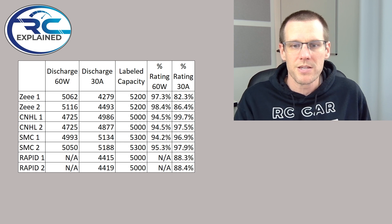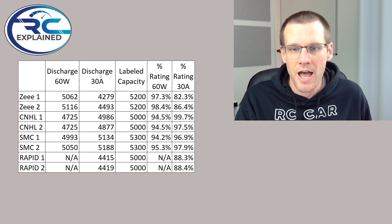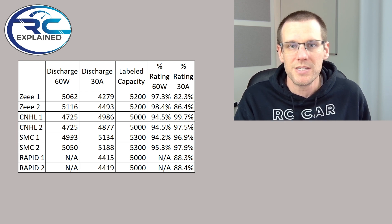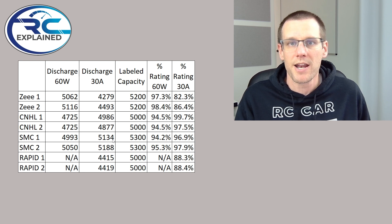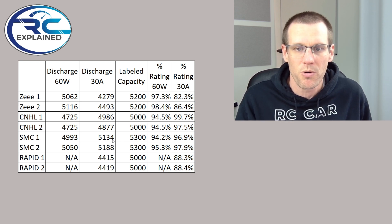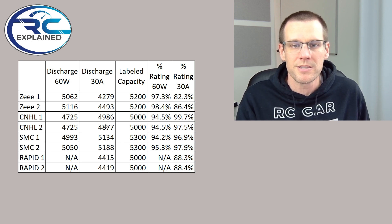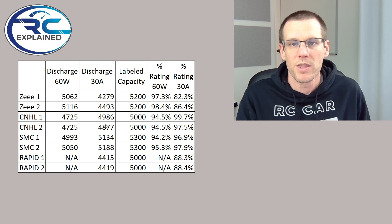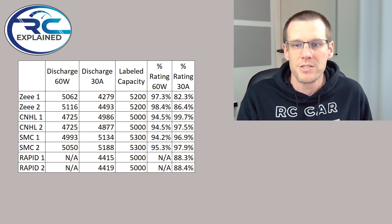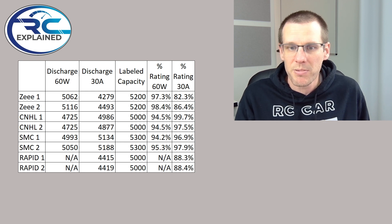What I found most interesting is that CNHL and SMC actually discharge less at a very low rate versus a higher rate. CNHL and SMC both only get about 5,000 milliamp hour at low discharge but deliver more at higher rates. I'm theory crafting here — I think it's because battery packs get warmer during higher discharge, and a warmer battery pack tends to put out more capacity and maintain higher voltage. We know cold battery packs near zero degrees Celsius or 32 Fahrenheit cause your car to struggle, with weaker capacity, weaker current, and lower maintained voltage.